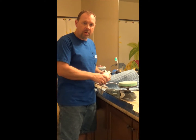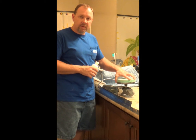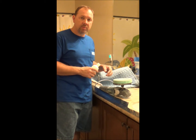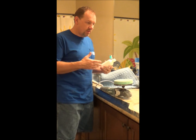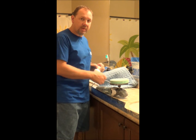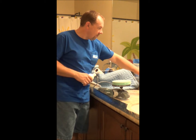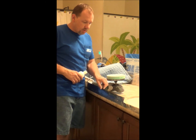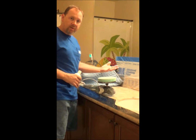So we're going to finish off the repair with the resin polish now. Like I mentioned earlier, we go to a seven-inch backer pad with a six and a half inch foam pad. This is the green cutting pad that we use with the resin polish. I highly recommend when you're working in a house — because this does have a tendency to splatter — do your due diligence and protect to keep all of your splatter contained as much as possible. As you can see, I have my film and my masking up on the back here. The aluminum tape works great as a stop gap for splatter coming back at you.